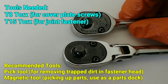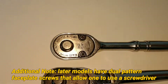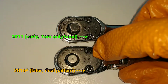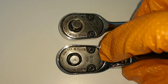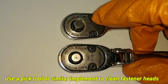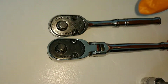If you have an early dual 80 technology ratchet it's going to have the single pattern screw, such as my 2011 example. If you have a later model, like 2013 or later, they'll have the dual pattern screws which also have a flat head. I don't recommend using a flat head on these because they will strip. I do highly recommend using a pick or some implement to clean the gunk out so your bit has good purchase on the fastener.